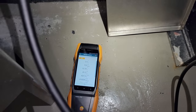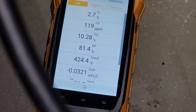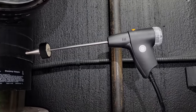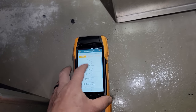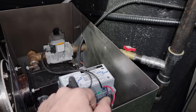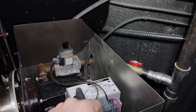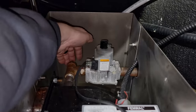As far as the draft, you can see we got 0.02. Usually you don't need a lot — you can go almost from neutral to just a slight negative from what I was told on the other burner. This one here, I have very little to no specs on it at all. Pretty much all the documentation has been burned off, which kind of sucks. But that's what the analyzer is able to do for you — it can tell you whether it's burning clean or not and check your draft, which is pretty awesome. We've got our excess air, our efficiency, O2, and CO2 — it's all right there. We could actually probably lower the gas pressure possibly. We've got to check and see if it's maybe over-firing and putting too much fuel in. If you've got too much fuel and not enough air, it's going to burn dirty. You've got to have the right mixture.